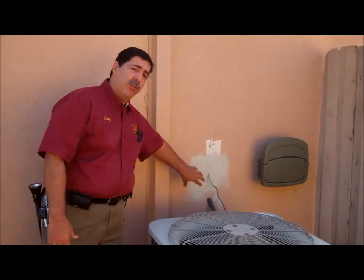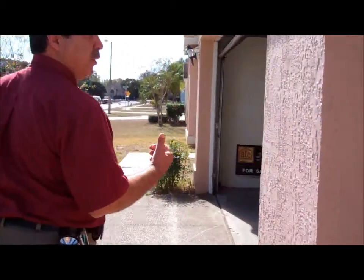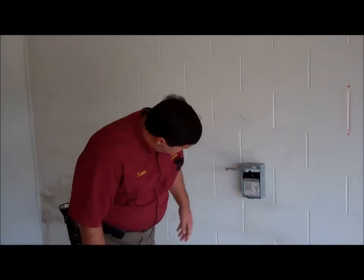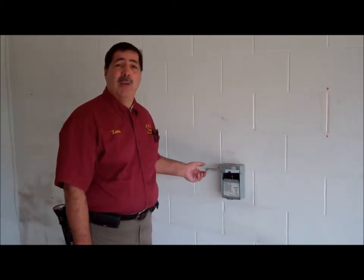We'll run into the garage and we'll show you what they did. They took it from here, and I guess they were trying to protect it. So if you follow me along here, they do have it, but they put it into the garage. Normally you don't want it here because the unit's on the outside, and if you have to de-energize it, you can't. So here's a pull breaker — this guy should be put back on the outside.